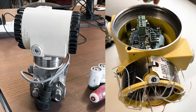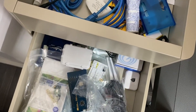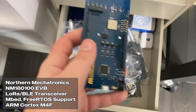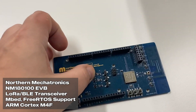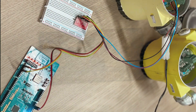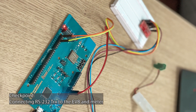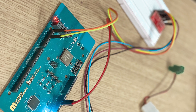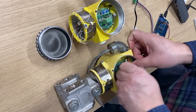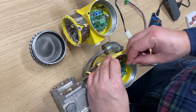For implementation, we always iterate on the design as we go. The first thing we grabbed was a Northern Mechatronics EVB with the NM180100 module on it — we always keep these on site. We wired it up with an RS-232 transceiver on the breadboard, which proved out the serial connection and communications and let us implement firmware to run on the AMBIQ Apollo 3, which has an ARM Cortex M4F processor. The code was written to send and receive Modbus commands over serial, essentially turning the NM180100 into the Modbus Master.